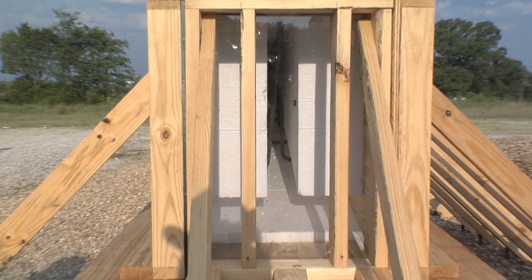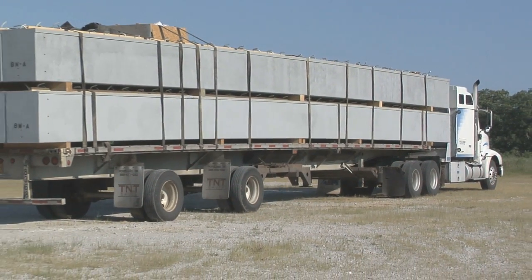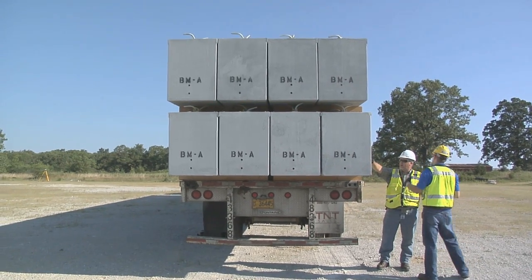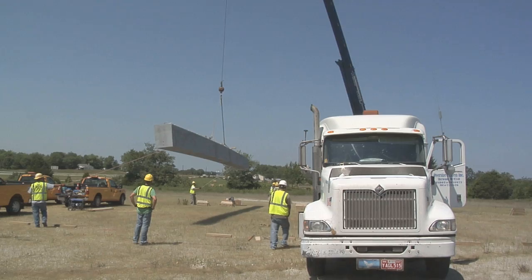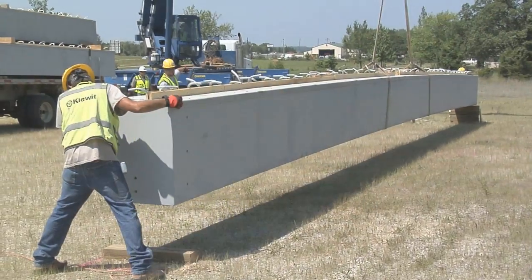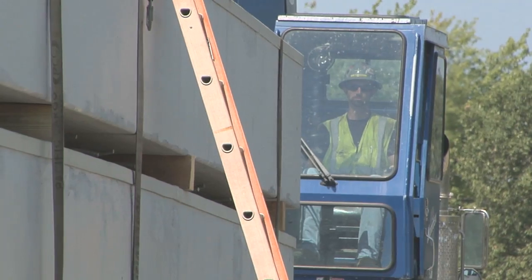You can take these beams — several of them on a truck. It can fit six beams or more on one truck, take them to the job site, and then offload them there, as opposed to a standard beam, which are so heavy you can only ever put one on a truck. So you save a lot on shipping costs. You can also use a smaller crane to set the beams, since they're so light.